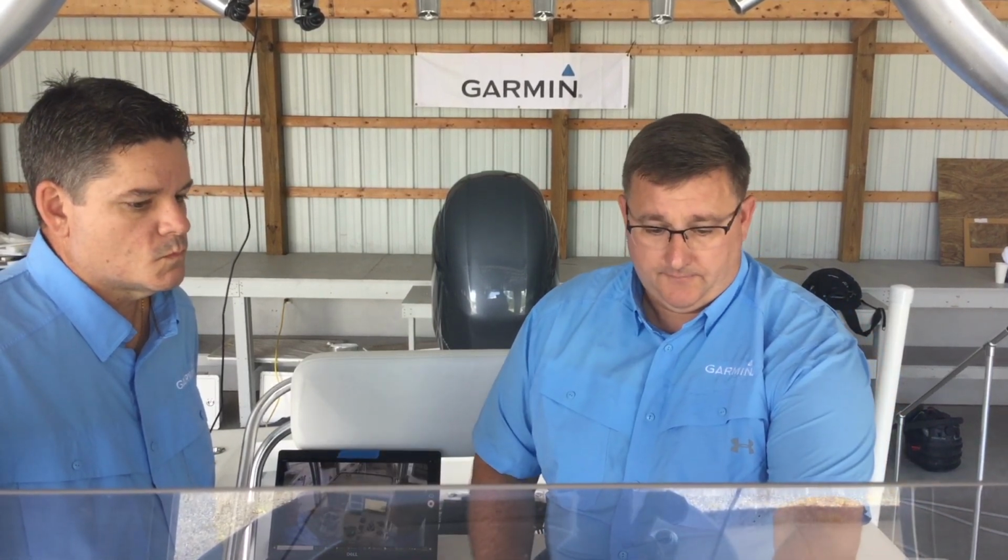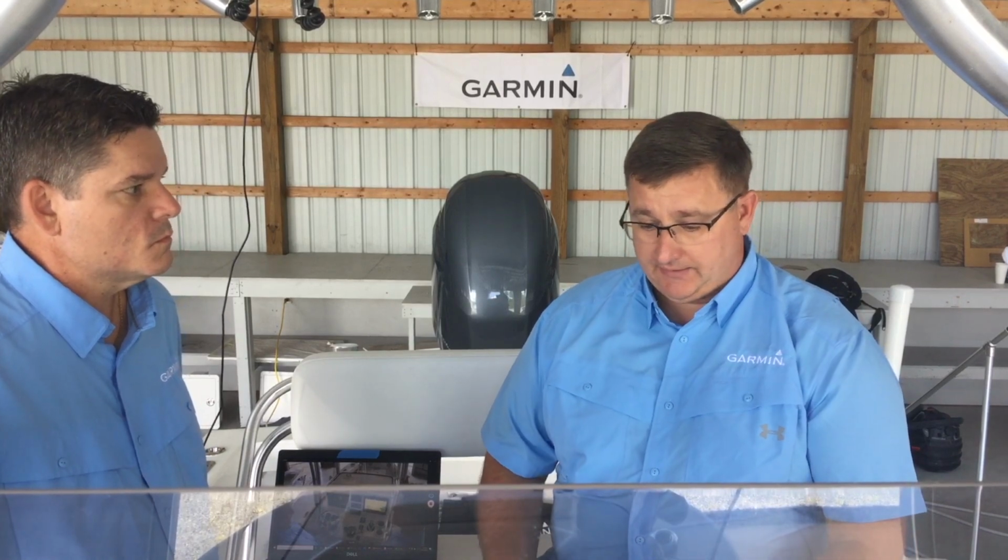So when we go to set up tactical switches or hard switches, if your boat has switches already in it, you want to be able to switch it manually from those switches as well. What you have to do is use a momentary switch instead of a latching switch. So have it so it's just a momentary switch, and you want to momentarily switch the ground for the corresponding harness for your tactical switches.